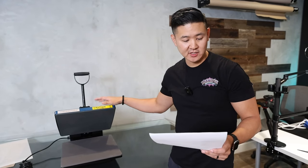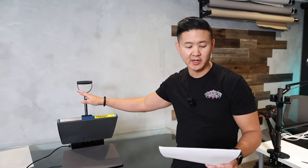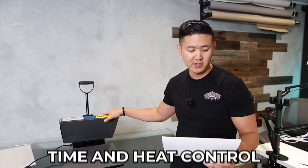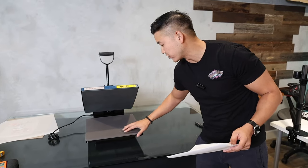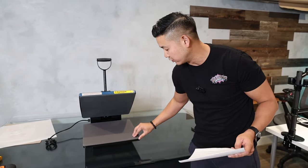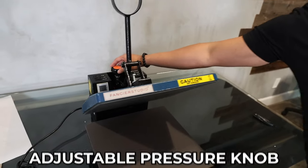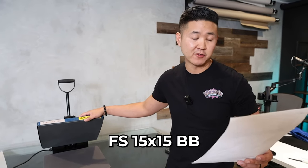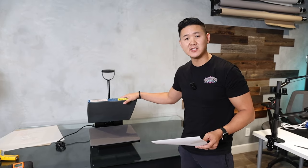This is a 15 by 15, 1,400 watts, 110 volts — plugs into your standard regular outlet. Temperature goes from zero to 500 degrees. It has electronic time and heat control. The silicone pad is actually slightly glued, which is very different from others I've seen where they move around — this one stays in place but you can still replace it if needed. It has a pre-adjustable pressure knob in the back. The model number is FS-15x15-BB, the blue back model. We're going to put a product link below. Let's go ahead and fire this up and see how long it takes to heat up.